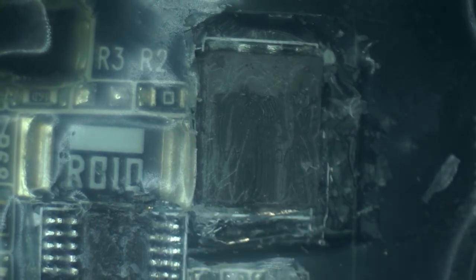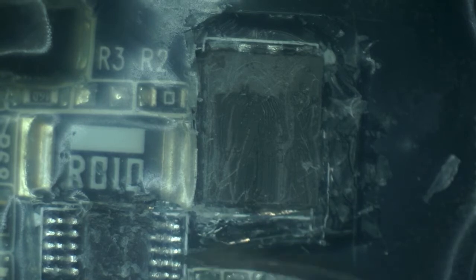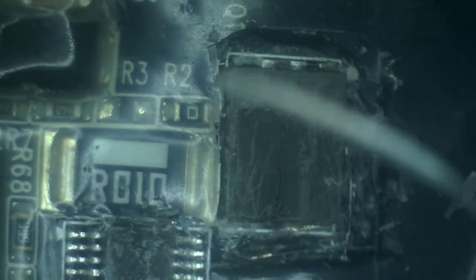Then it's got the current sensor logic off of this resistor over here, so some of the pins are responsible for that. It knows how much power is being produced, so how much voltage is coming out of the MOSFET when it's on. So one of those pins is responsible for that as well, and a few other things. So again, this particular controller is very, very important.